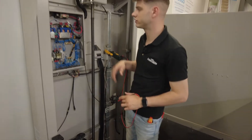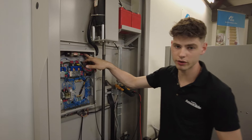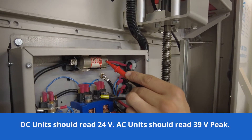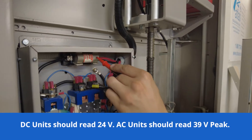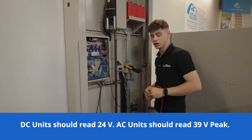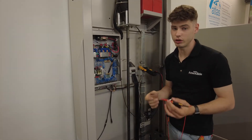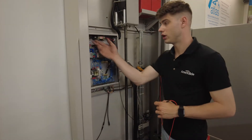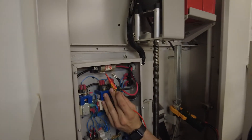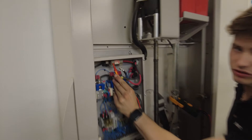The first thing that we test is coming from the batteries — it's a main battery bank that's coming down to our main fuse on the right side. We can just come here and touch the fuse on the tip. As we see, we have 27 volts — that's good. Our second test is to verify that the voltage is going through that main fuse, so all we have to do is test the opposite side. The black wire is not a ground, it's still positive, so we're going to touch the left side of the fuse. My voltage is 27 as well — the fuse is good.